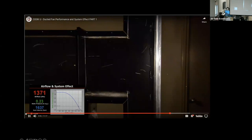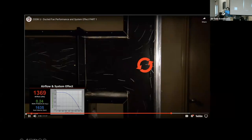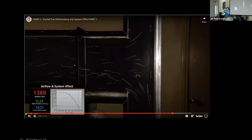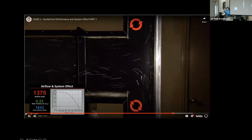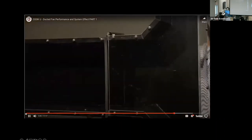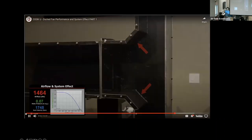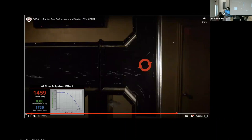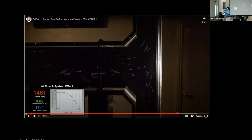The pressure loss of the fitting is not terrible. Looking closer, we find that a small dam of air formed where the airflow splits, guiding the air to each branch. As we saw with the square elbow before, we are getting turbulence after the turn, contributing to the loss. Next, we have taken the bullhead T and mitered the throat of the fitting. This opens up the throat area, providing more room for a smooth flow in each direction and minimizing the turbulence downstream. The pressure drop is similar to the square elbow with turning vanes or short radius elbow.